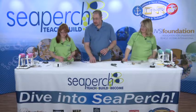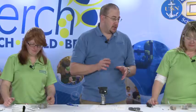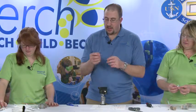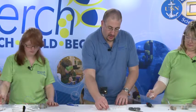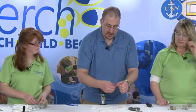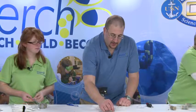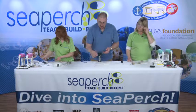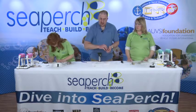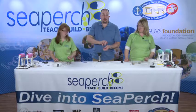Now that we have our motors waxed, we're going to assemble our propeller assemblies. Each consists of a single rod end, a propeller, and two nuts to hold them together. The first is called a T-nut or blind nut — it has sharp prongs on the backside. The other is a lock nut with a small nylon disc that bites onto the threads so it won't come off.